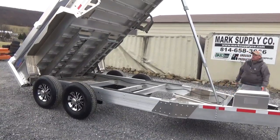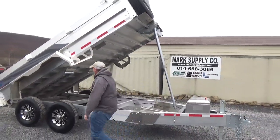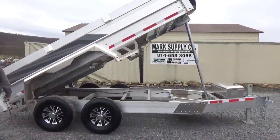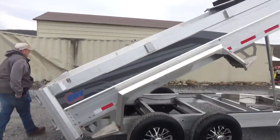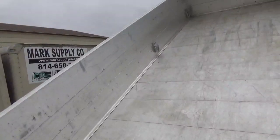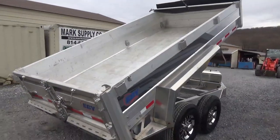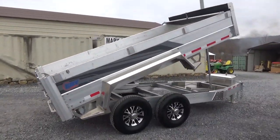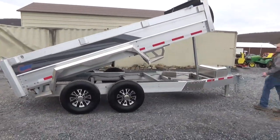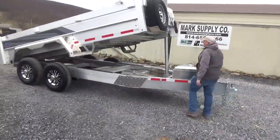We're going to take our stuff out. We're going to let him come on down. One other thing we'll show you here in the back. Keep it lighted up. You can still see it here. I'm going to go ahead and stop that coming down so you can see. This trailer has 3 sets of D-rings on either side, which is very nice for securing. If you put a piece of equipment in it, you have that ability to secure it. Go ahead and bring him on down. Another nice thing, your trunnions up here where your telescopic hoist pivots are fully greasable.